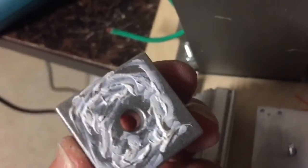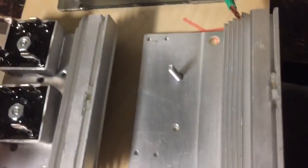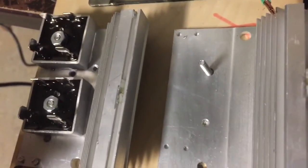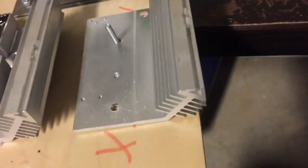I'm applying some thermal paste to each of these diodes — these are bridge rectifiers, rated around 30 amps. I'm connecting four of them together in parallel, so I should have a good amperage rating. I'm also putting in some pretty nice heat sinks that I got out of an old computer power supply.